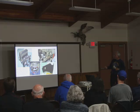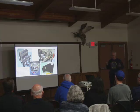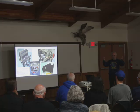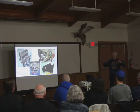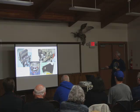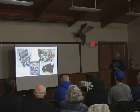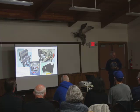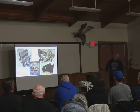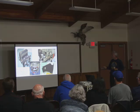This is the optics bench, there's the lens. Lenses were still relatively slow, like f16. But the light came through here, bounced off a prism, and then came up at an angle, so the two light paths deviated, and we could fit each one into a CCD. This is what the filter wheel looks like. It's really fun torquing all these little screws and not slipping off and damaging the filter. When you get that done, you say, oh, geez, go home and just relax now.